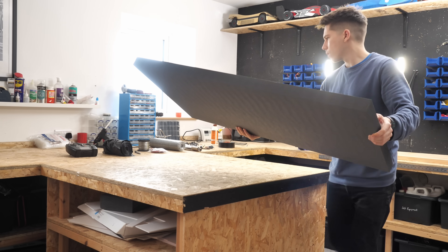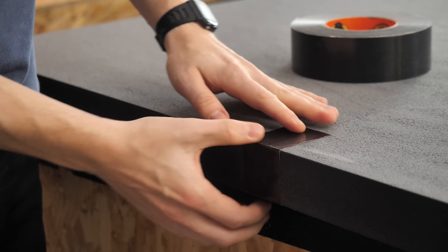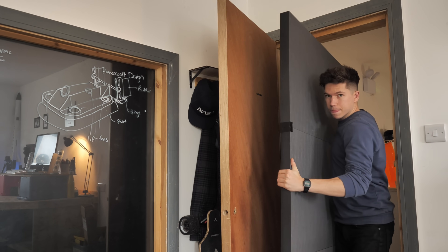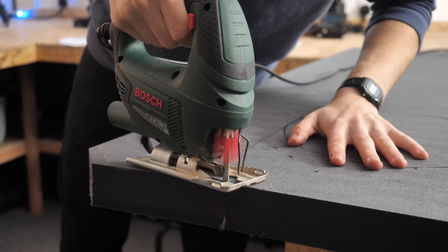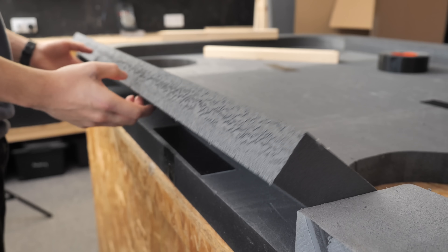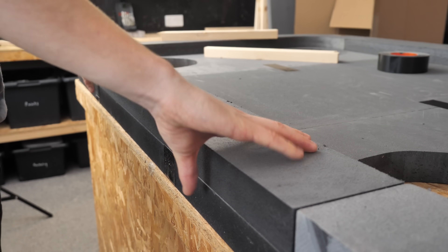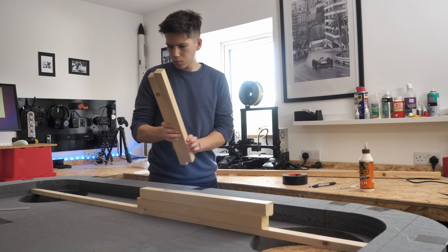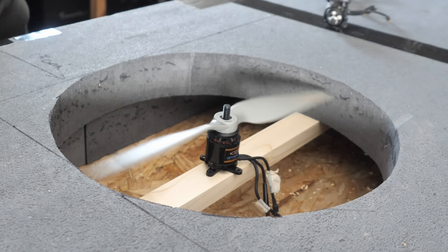Now I needed to figure out how I was going to build the full-size hovercraft. I wanted it to be lightweight and compact so I could build it in my small workshop and lift it through the door. So I started with some insulation foam. I made some more templates and rounded the corners with a jigsaw, then added some more foam to double up the perimeter of the hull where the donut-shaped skirt was attached. For added strength I glued some strips of wood along the underside and topside, which would also double as hard points to mount things to such as the electronics.